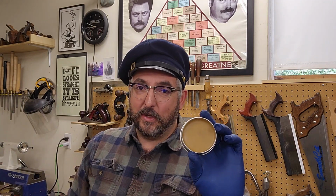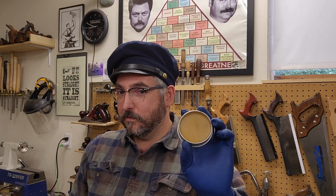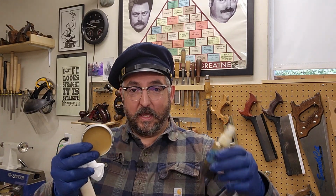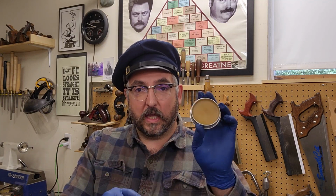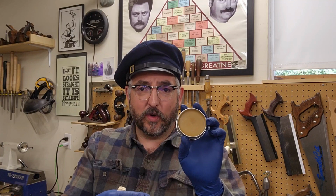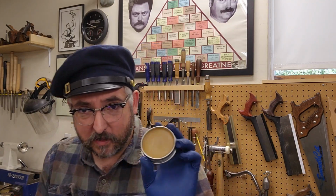Now, once I learned about that and I started digging, I'm really into axes. I split cords and cords of wood every single year, but I also noticed that when you go looking for axe handle wax or axe handle care items, you'll see a wax that looks mysteriously brown, like it has pine tar in it. So this is still readily available and sold on places like Etsy. So people are still making it. So this is the solid form of boat soup. So I just take the same recipe and I mix it with beeswax. So once I have an item thoroughly soaked and coated, if I'm just doing a maintenance finish, or I'll rub this on my axe heads and stuff like that if I'm going to store them outside, or if we're at an event and they'll be out in the moisture a little bit, I'll rub this on the steel too. And it's great for handles if you like wax finish on your handles.